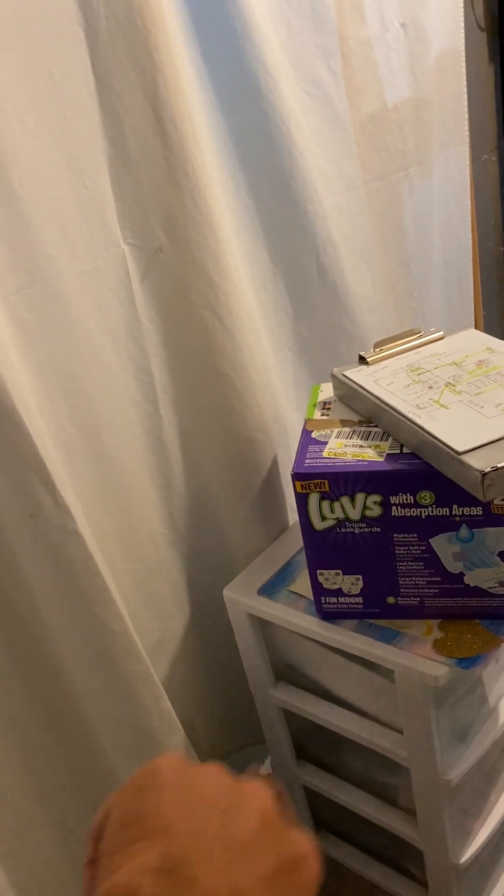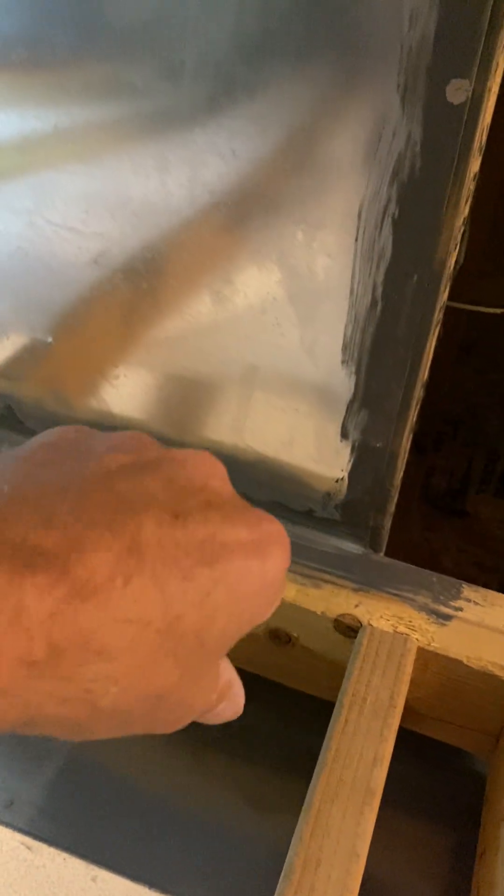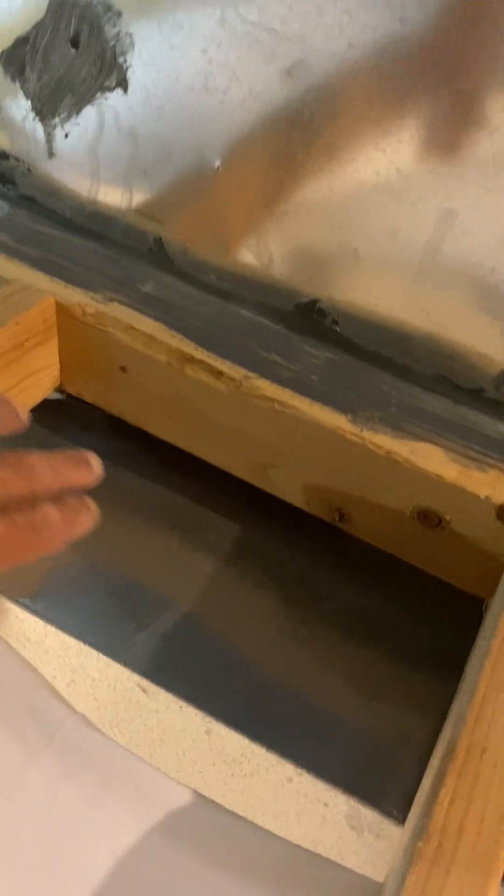In the hallway we're going to put a 30 by 8 baseboard grill. On the furnace side, we have this return air right here — we're going to put an 8 by 8, 33-inch-long return air collector. Then we're going to pan both sides of the wall as per scope.